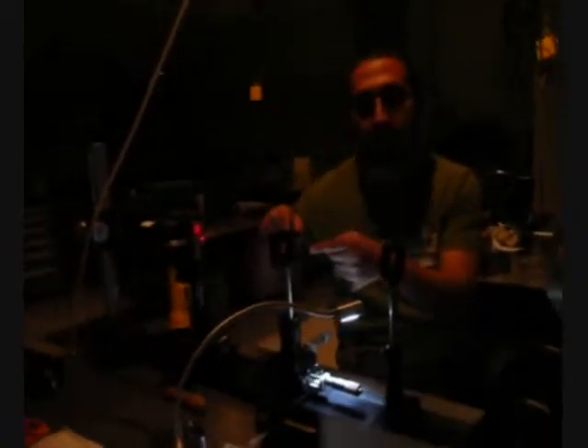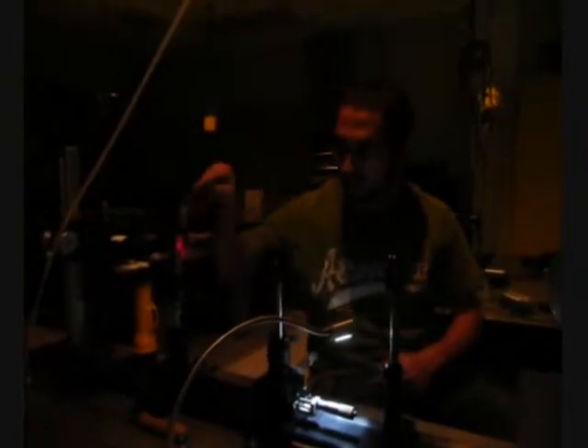Hi, I'm Najee Barakat, normally in lab group 4A, but just visiting this week. For this section, we've changed the orientation in the lab so that the curved surface is now facing towards the laser. With this orientation, we're going to get more aberrations than we did in the previous orientation. If we look at the interferogram, you can see that spherical aberration is more apparent in this setup. Now I'm going to defocus the lens, and we see that the sensitivity is pretty much the same as before.